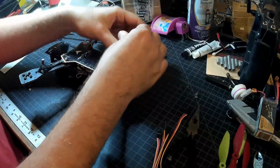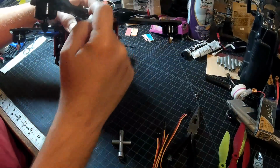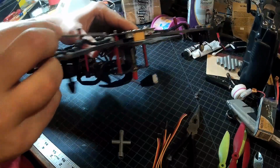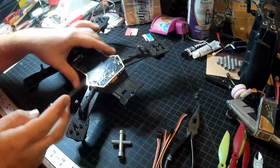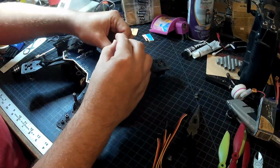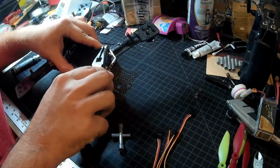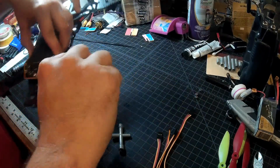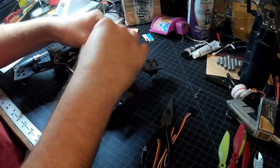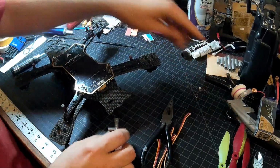It's just six nuts. One of the nice things is that these spacers inside of here are threaded, so when this board comes off, your arms are going to stay in place, which is kind of handy. Makes it a little easier to do this kind of surgery. So yeah, this one here isn't coming, so do not do this. Get a proper 5.5 millimeter socket. Don't do it the way I'm doing it. As soon as I get that loose, I can go back to using the socket, but I promise I'll pick up a proper socket soon, so I quit setting a bad example.